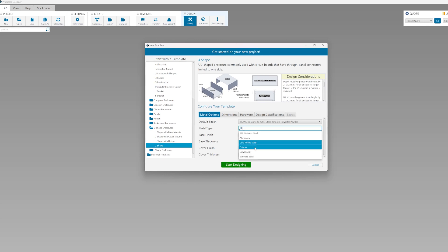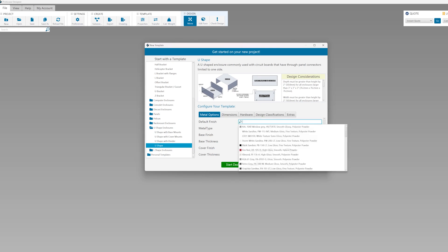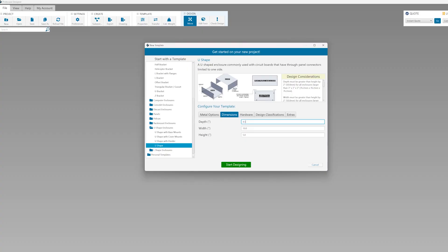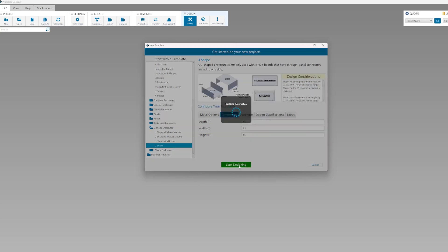What about the material? We're going to select aluminum, as the metal provides excellent heat dissipation and added corrosion protection. Let's also make this enclosure traffic blue — it's a great color. For dimensions, taking into consideration the mounting specifications mentioned earlier, we have a component that is 8.56cm x 5.65cm. We want to ensure we incorporate our clearances and allow space for airflow, so let's make this enclosure 4.5 inches by 4.5 inches by 1.5 inches. This size is sufficient to house the board and provide space for connectors, ventilation, and any additional components we may want to add later.